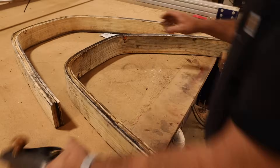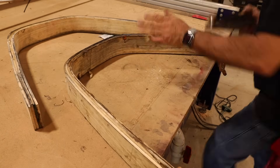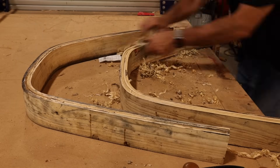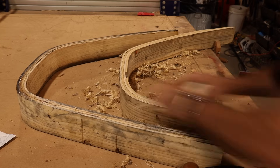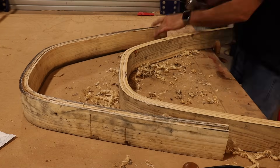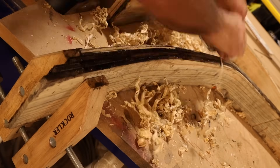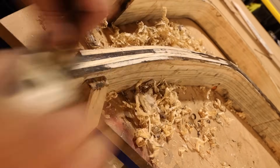This will stay on the form overnight. So now this is a couple days later — I glued the second one, didn't want to be so redundant. And I'm working on the sides of my chair. I'm still not 100% sure what I want to do on the seat at this point. I know what I want, I have a vision, but I haven't defined the exact shape. But you can see how with the Titebond 3, it turns brown, and also you've got some stains on the wood from being inside the steel tube. But I know from experience all that just cuts away.